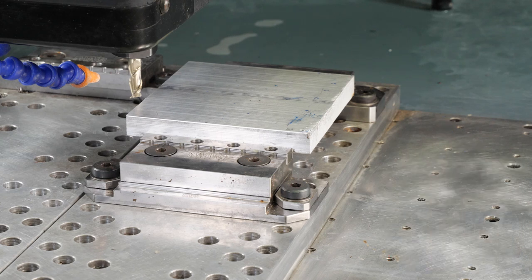So I'm coming over here to cut control, spindle on. Bump it up to about 4,000, which is a nice good cutting range. And what I'm gonna do is touch off the side of this part real slow, and then we're going to move our DRO over.